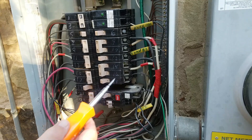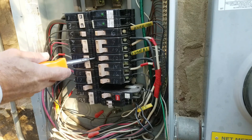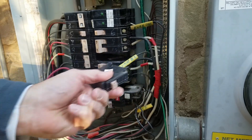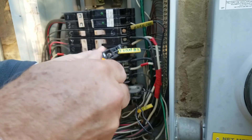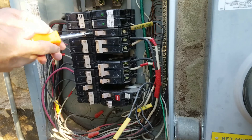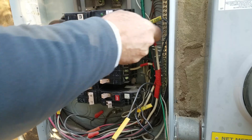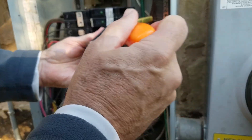What we want to do is take these two off and move them down. The first thing is to pop this out so the circuit is not complete — even though we tested that it was off, now there's no power going to it. Then we come in here, undo that screw, and we're good to go. We'll do it again with this one up here: pop it out, make sure we get our wires in the right order. No circuit again, even though we tested. Just want to be safe — unscrew and we're good to go.